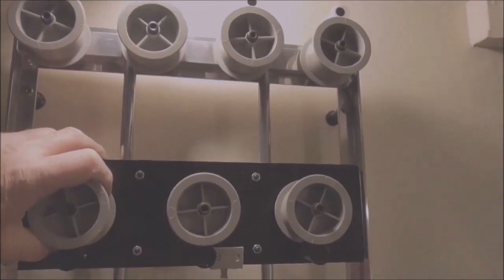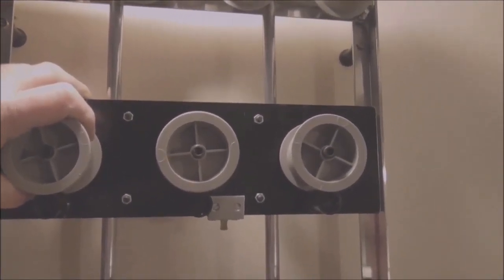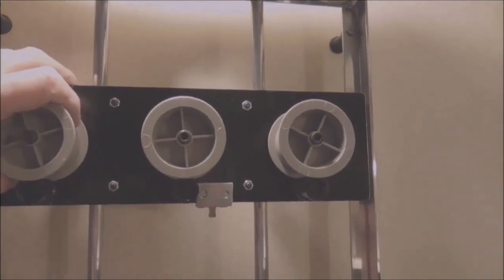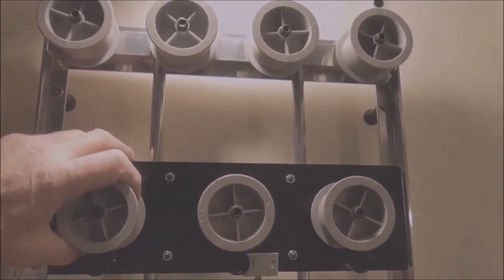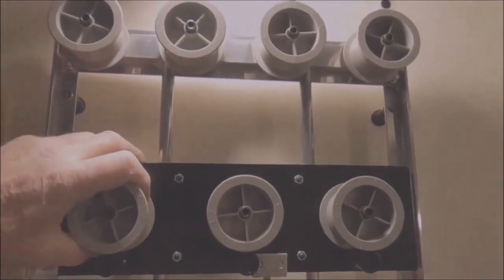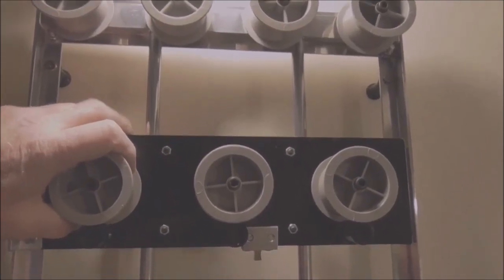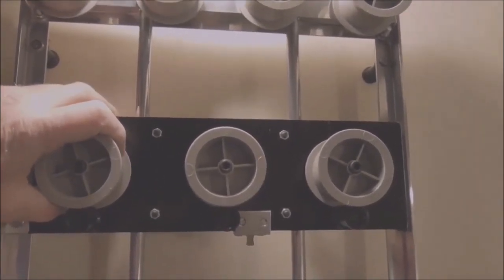And this is providing a safety for the projector so that the projector, no matter what the platter does, will never be under any strain. Because with polyester film, all hell can break loose if things get a bit tight. So this will shut the motor down.